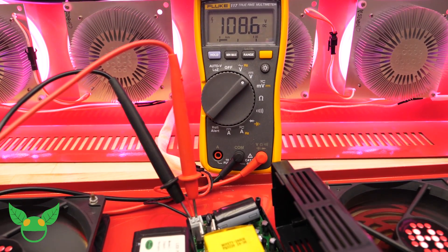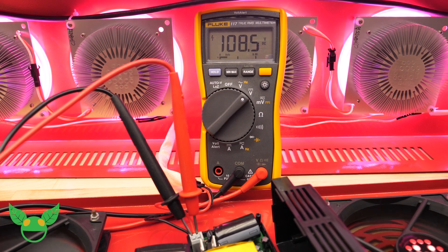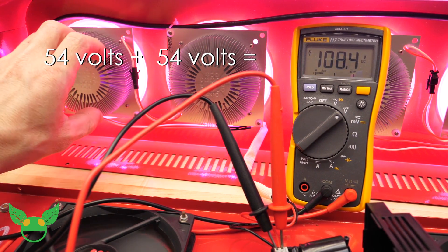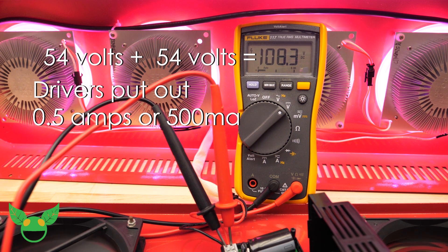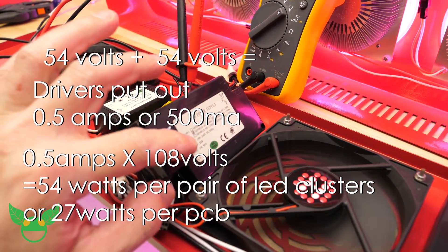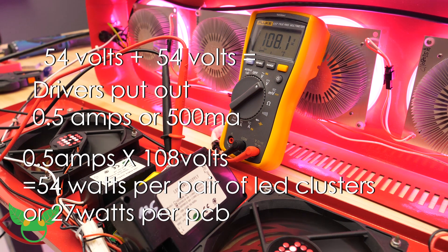So I went ahead and stripped these wires a little further to get my multimeter pins in with the LEDs hooked up. Looks like the LEDs need about 108 volts. And I'm noticing that they're pigtailed together in series with this connection here, which means each of these banks of LEDs is 54 volts. In series, you add up the voltage — so 54 and 54 is 108. That makes sense because we're running at half an amp. Any voltage we have, we multiply by 0.5 — or divide by two — to get our wattage. So these drivers clearly say on them that they're 55-watt drivers. 108 times 0.5 gives us 54 watts — so we're getting 54 out of the 55 watts. Pretty simple.